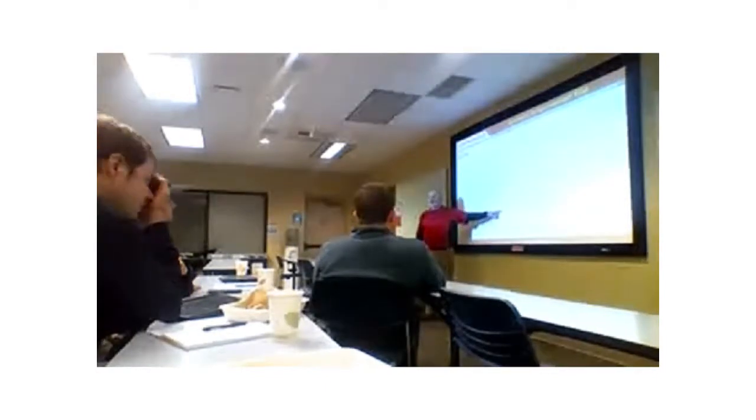Here's the system information file. Anyone who's ever used the maintenance tool, this is what we call the grid screen. It also shows all the connection info down here. I can see my address of my units, what type they are. This AU is a hex unit, that will be heat exchanger, water to air, refrigerant heat exchanger.